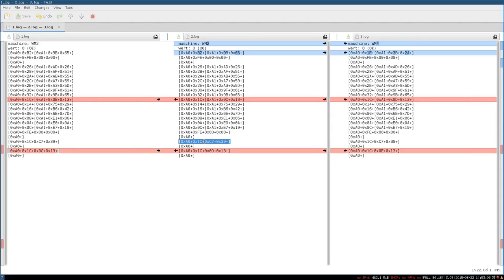After the end of the transaction, it writes the read counter at the static value, some sort to reinitialize it. After it writes at 1C at the read counter, it will put the previous value incremented by 1, as you can see here. So the first byte is the least value. And we can see that it's 0D, which we find here on the right, and then we have 0E, so it's again incremented by 1 after it's been reset to a default value.